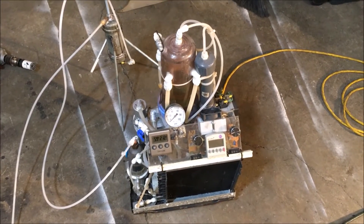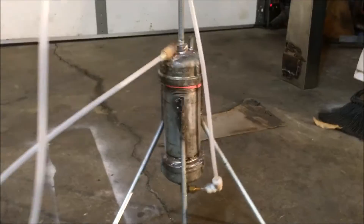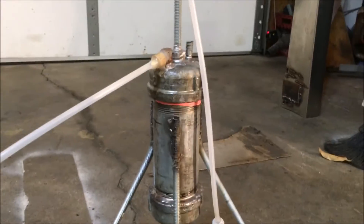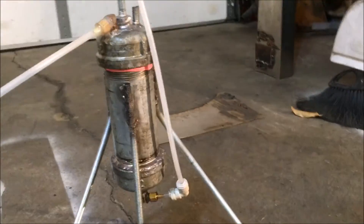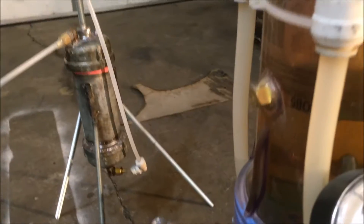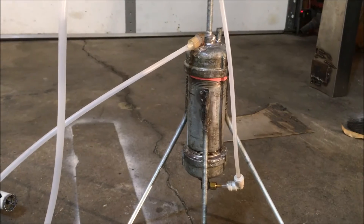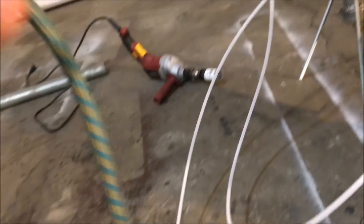For anyone unfamiliar with oxyhydrogen torches, or HHO torches as some call it, that is how I'm producing this acetone flame — this isn't just pure acetone. Basically this canister is about this full of acetone, and there is a small micro screen and an air stone type action inside that bubbles the oxyhydrogen gas through the acetone, which is then connected to this torch.